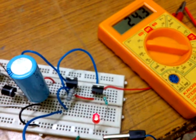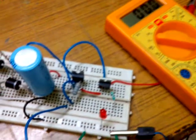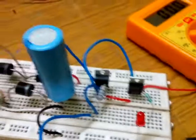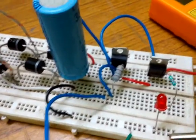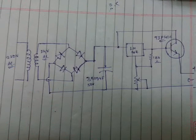Now we can see how to regulate the voltage from zero to 30 volts using this high-power circuit, and you can control the current limit from 0 to 3 amps. We can also carry more current but we have to change or use more powerful transistors — you can check that out on the internet. This is the complete circuit: you can see the 220 volt AC input from the transformer, the 24 volt AC output, the bridge rectifier, the filter circuit with the capacitor — you can add more capacitors or an inductor. This is the LM317 voltage regulator IC, this is the power transistor, and this is the potentiometer used to control the voltage, giving us the 0 to 30 volt DC output.